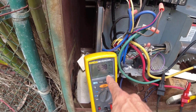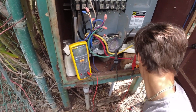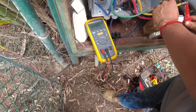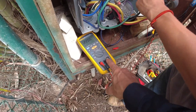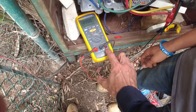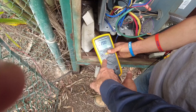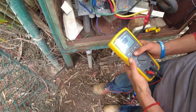540 million ohms — see the M there, that's millions of ohms. Good. Now the next test we're going to do is winding resistance. The insulation probe goes over here and the ohms probe goes there. Before you run tests, always make sure you're in the right function — we're in ohms — and always make sure your probes are correctly connected and everything looks good.